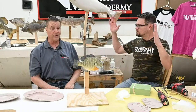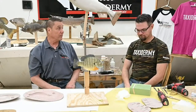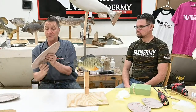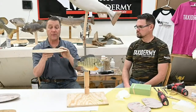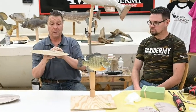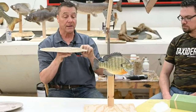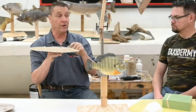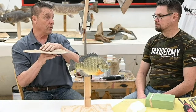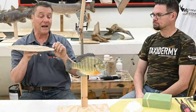It'll give you a really nice ledge and make your mold give you a professional mold, which is kind of important when it comes to reproduction fish. So we caught these little fish, and last week in the first session, we laid one up in our premium bedding fiber and poured auto body putty over it. That gave us something that looked a little bit like this, with the bedding material out to the outside. We thinned our auto body putty with polyester resin so that it's nice and creamy and pourable. If you use straight auto body putty, you're going to get it very, very thick, and thick will cook your fish before you're ready. Probably a lot of bubbles too.